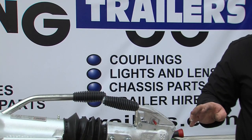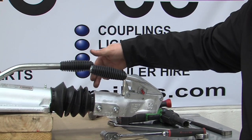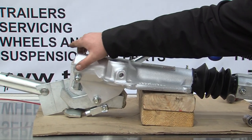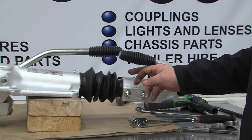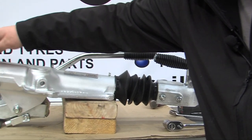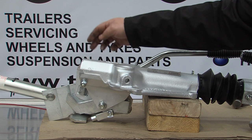There is also another way of fitting the coupling head if you don't have a pin. You knock the bolt out and remove the back bolt on the damper. Once the back bolt is removed, the bolt can be lined up on the front, and with this section at the back it is easier to line it up by putting a podger or a screwdriver through the back and sliding the bolt in from the back.